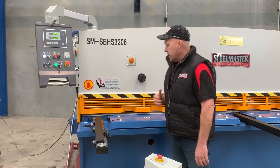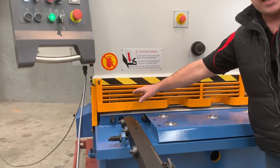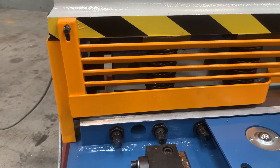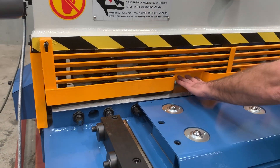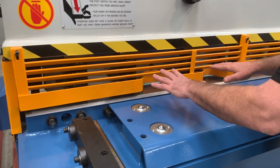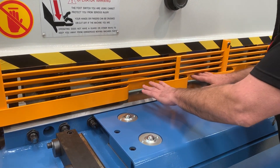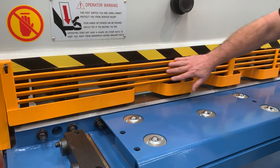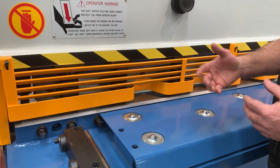Being an overdriven heavy-duty industrial guillotine, you've got a series of individual clamping jacks. These clamping jacks, which you can see through these louvers, give you full force of clamping right across the beam. One of the improvements we've made over the years is recessing the front guard here, so you can actually get it nice and close and push the material close to the actual blade itself. We've also louvered the front guards, giving you a very easy viewing area to your cutting area.